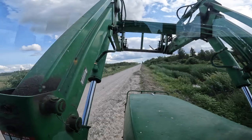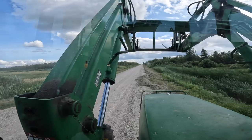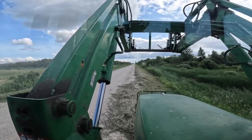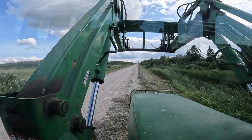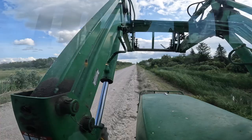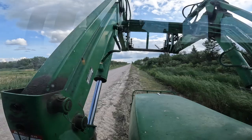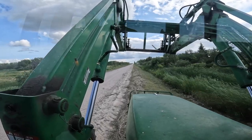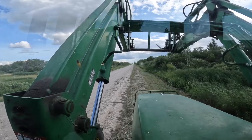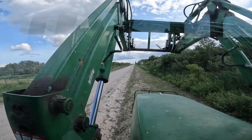This gets really steep here — it feels like I'm going to tip over. Whoa — holy crap, that was scary! There was a huge dip — a give in the road — and I couldn't even see it because the mower cut over it and the grass is still high there. I'm not worried about the tractor, I'm worried about the baler twisting and flipping, especially if it's lopsided. Right now it's a little over-heavy on the right side, so I've got to start packing the left.